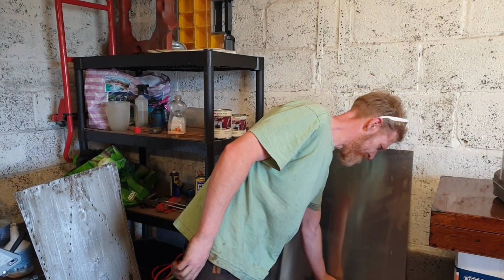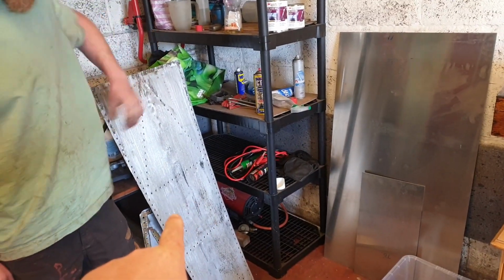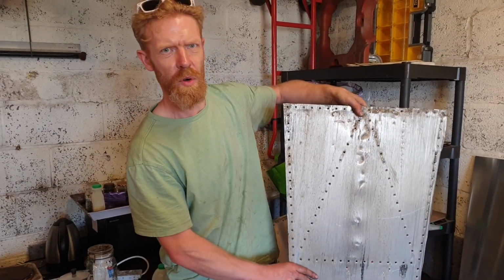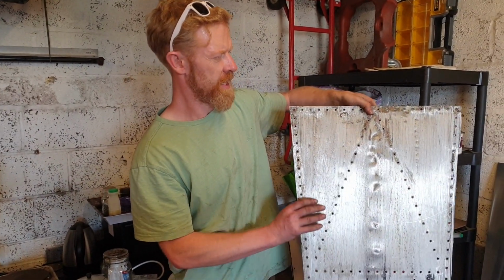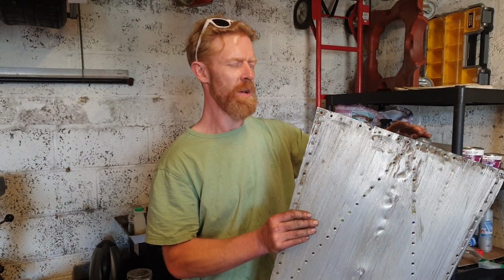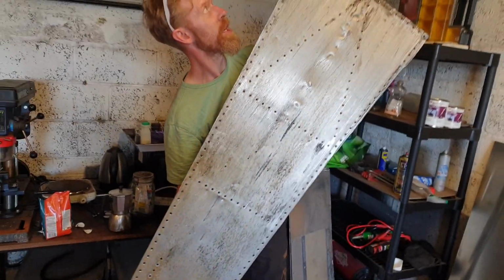So we're at StrongBroo headquarters here with the mighty Neil. Once again, you will see him in other episodes here if you want to get a catch up, and we're discussing aluminium. Yes, much of it. So we're going to skin, as we've discussed, the bottom of the car, and there are two different samples here. Now we've done the first scuttle in something very similar to this. This is actually the old floor off my Formula Ford. This is the normal grade of aluminium, which is 1050, which is the regular stuff you get out of the metal suppliers. And if you'll allow me to demonstrate without banging anything,